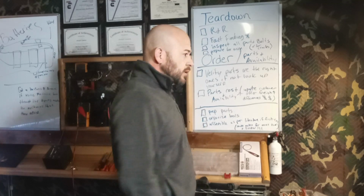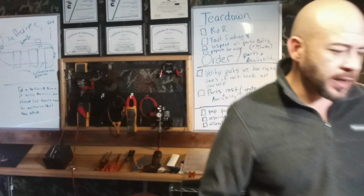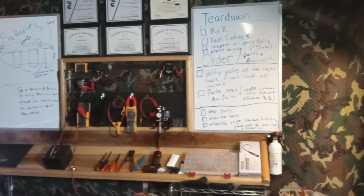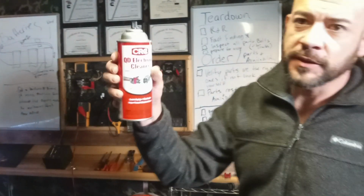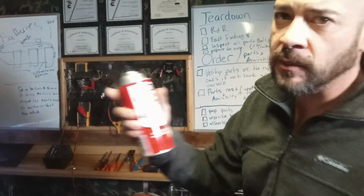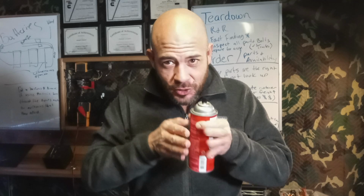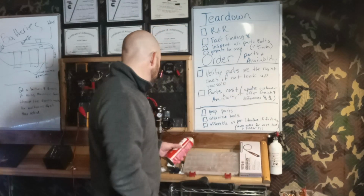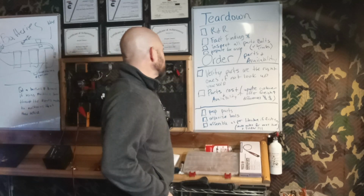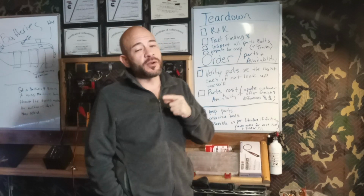I use CRC electrical contact cleaner, QD electrical contact cleaner. Sorry for going out of frame. This stuff, if you spray this on something with a hairline fracture and blow on it, Mario Correa taught me this 20 years ago, it shows you a very fine line that you cannot see often with the naked eye. Very cool trick. But you want to do that for your bolts and then look at them. I mean, remember, your name's going on this.